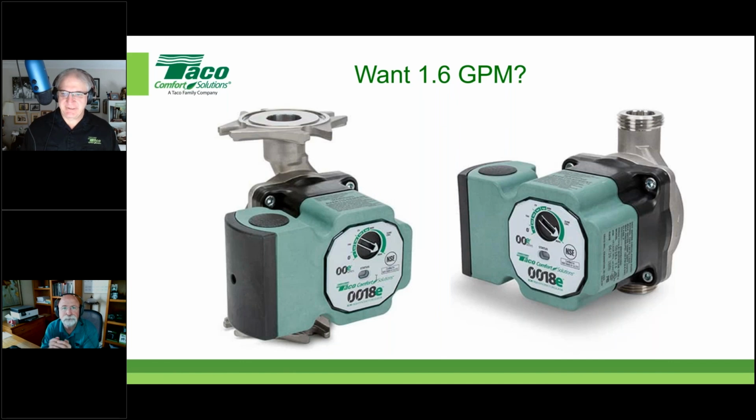Very good. But yeah, again, it's important to remember the purpose of domestic hot water recirculation isn't to deliver amounts of hot water to fixtures. That's the pipe sizing and the street pressure. Its purpose is to keep the hot water line primed. That's all it does. We're not moving volume, we're moving heat. We're moving warmth. Moving temperature might be the best way to put it. We want to keep the hot water line primed with hot water. That's all it's trying to do. It's not a delivery pump at all.